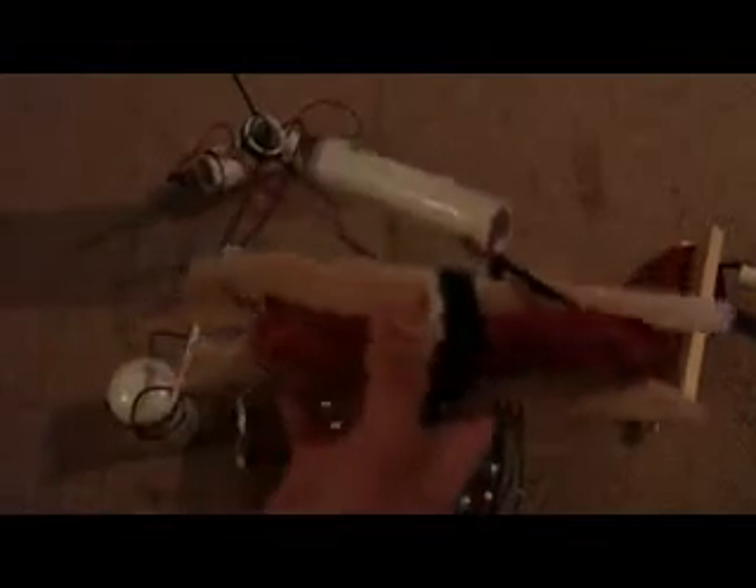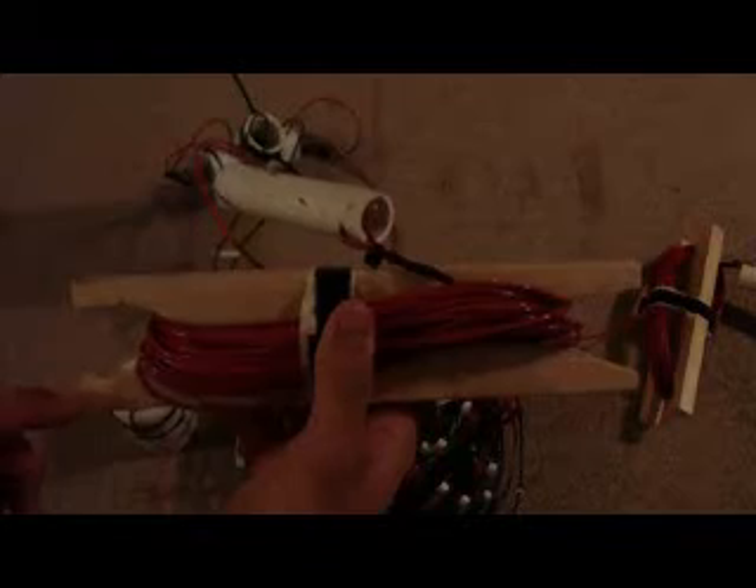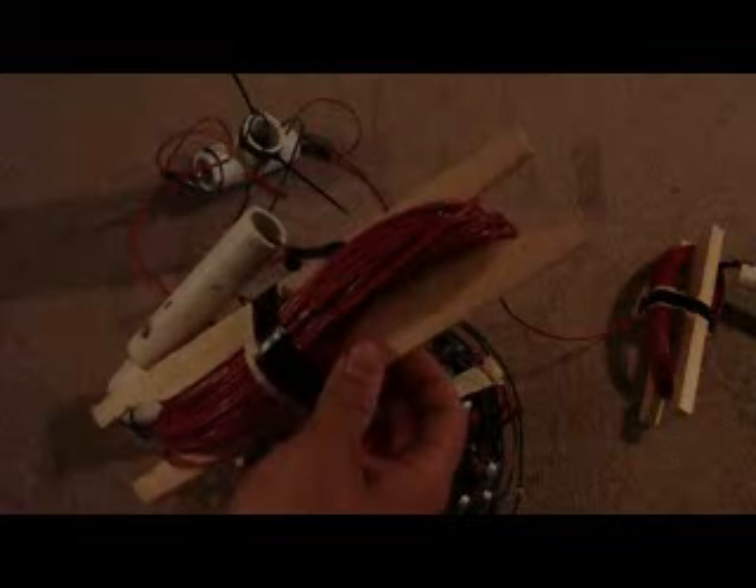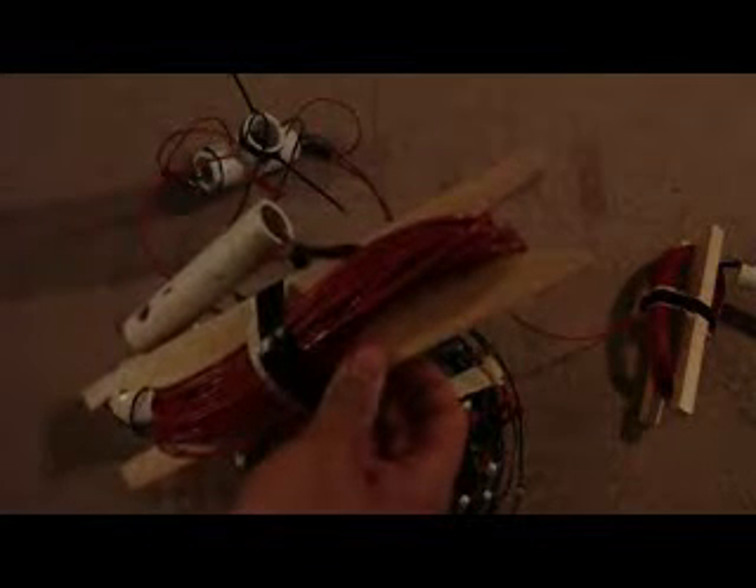For the ends, I'd recommend if you have some wire antennas, just take a piece of wood and notch out two ends on it like that, so you can wrap your cord around it. It holds your insulator like this — just roll it up all the way to the center. So whenever you go to undo it, you don't have to fight all the loops and tangles and knots in it. There's the insulator — I just drilled a hole through it, looped it back over itself, and shrink-wrap tubed it right there, zip-tied it right there. There's a hole right there for a rope to stretch it out.